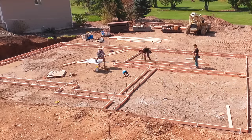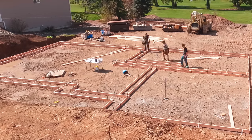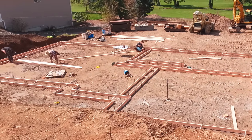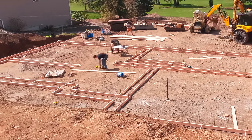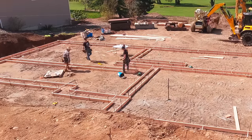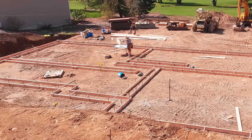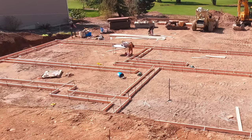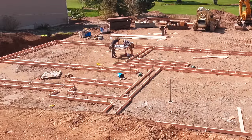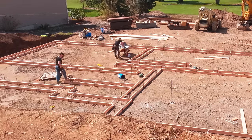Each of those is gonna be parallel to a back wall or a side wall. And that's why that right wall and the back wall, the right-hand wall and the rear wall, that's why it was so important to get those the right length, straight, and square, because those are now our reference for everything. So think of it like any other layout tool. You want your level to be calibrated, or everything you build is out of plumb or out of level. You want your squares to be perfectly square, or everything that you cut or measure isn't going to be correct. Same principle. We want this to be square. Unless, of course, the architect or designer calls for like an off-angle corner, but thankfully, we haven't had to do one of those in quite a while. That's a hassle.